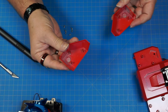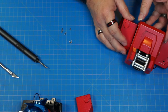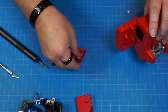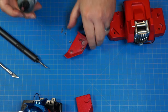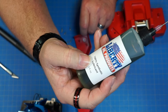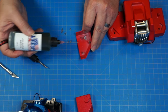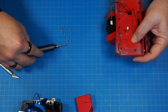Now we've got parts 5 and 6. Part 5 goes this way and fits over these three holes. I'm going to tighten that down from the back with three PWM 2x6 screws. Since it's going into metal, I'm going to put a little drop of oil on there — this is the 100% synthetic lubricant by Liberty Oil Products; I'll leave a link in the description. Put a little bloop on each one, go back on, and screw in with those three screws.